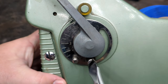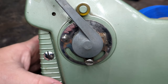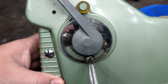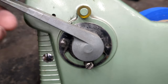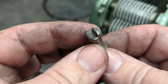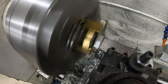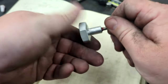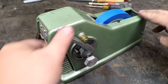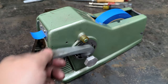Problem 3: the adjustment is not designed to be super easy to operate. I think these are usually used in warehouse packaging contexts, where some efficiency expert has figured out the exact right length of tape. I'd rather be able to quickly adjust it on the fly without needing a screwdriver, and the old screw was chewed up and nasty. Solution: make a replacement thumbscrew. It couldn't be too big or it would interfere with the lever, so I grabbed a piece of aluminum hex stock and created the thumb half of a thumbscrew on the lathe. The screw half was a commercial screw, cut off and Loctited in place — aluminum for easy turning, steel for wear resistance, and it looks a lot nicer than a thread cut with a die. And it works great!